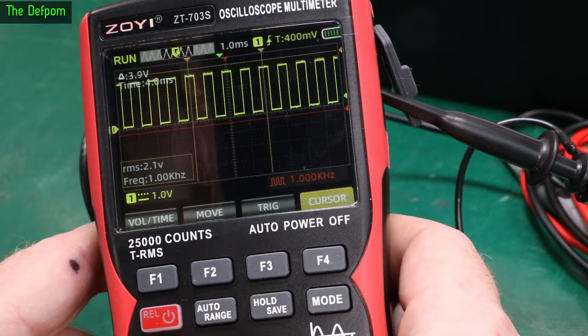There's a run mode option: normal and high speed. In normal mode it's best for signals below 30 MHz at 200 megasamples per second, up to 280 megasamples per second maximum. High speed mode is needed above 30 MHz but uses more battery. With both channels enabled, sample rate likely halves — dropping to around 100 or 140 megasamples per second respectively. Changing this mode causes the unit to reboot itself, kicking you back to channel 1.